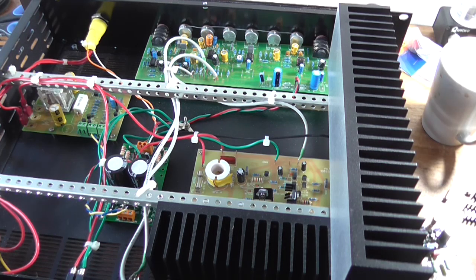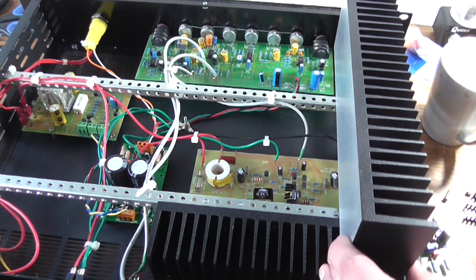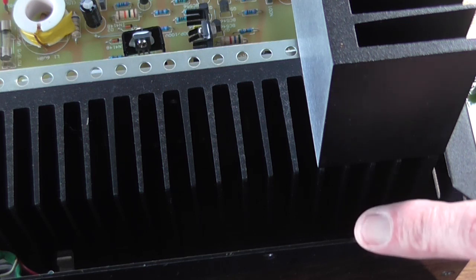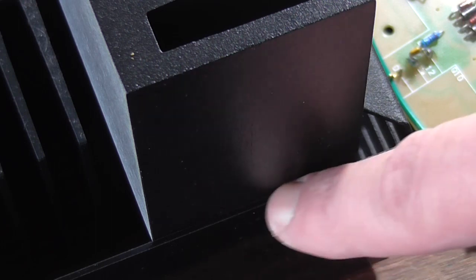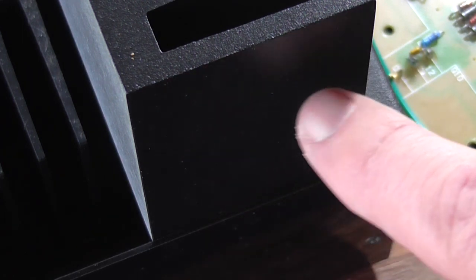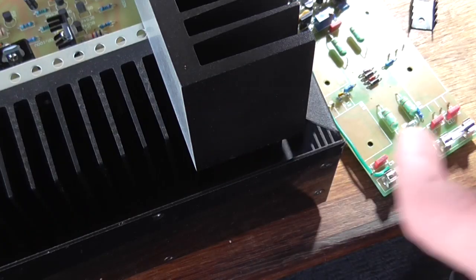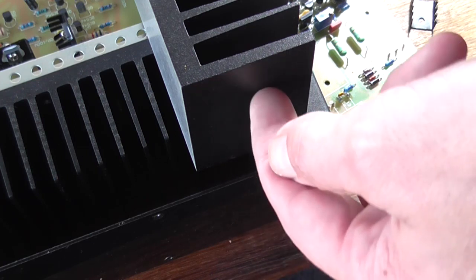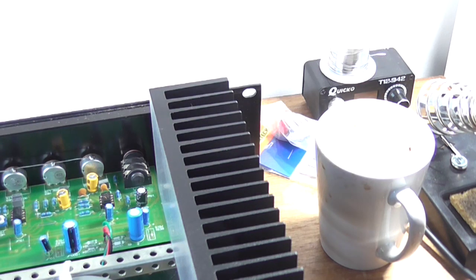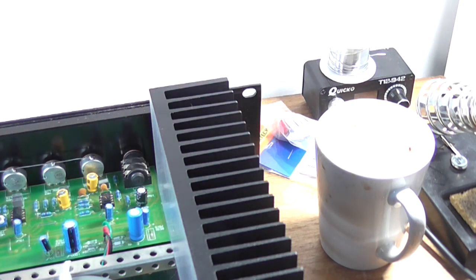The idea is to actually mount the heatsink sideways in the case. I've got plenty of room — sort of plenty of room here that I can actually have this heatsink, because it'll be on one side of the case, close to the back panel. Now I can't mount it flush to the back panel because of those lips again. However, I can probably put spacers or washers — like 10mm non-threaded spacers away from the edge — and then put an M3 screw at four points on the corners of the heatsink and run two rails top and bottom at the front. That should still leave me enough room — at least a good 70mm or so — to have an input circuit board.